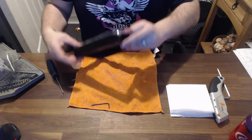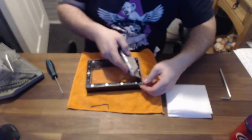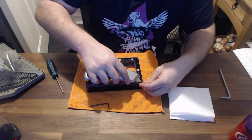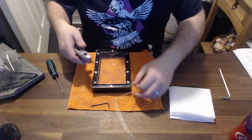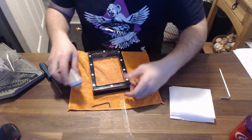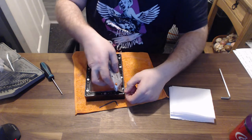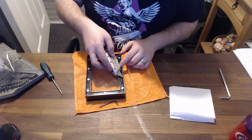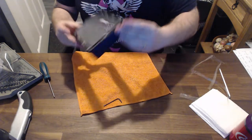I've over-tightened that side slightly — it's got a nice twang to it but it's just slightly too high. Now it's all in, I'm going to take off the excess FEP, just very carefully running the blade along the little ridge. It's sometimes good to do it up a little bit tighter so you've got that ridge as a guide, and then loosen it up after. These outer screws don't need to be overly tight — they're not what stop the resin coming out of the vat, they're just what keep the tension of the FEP. The eight screws underneath are what keep the resin from coming out. So I'm just very carefully taking off all the excess along the edges and tidying that up nice and neat.